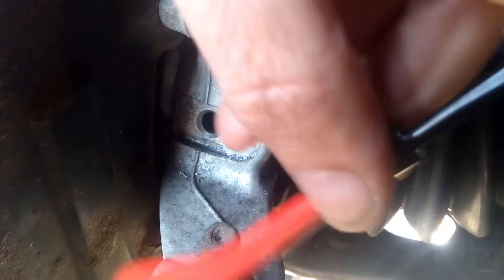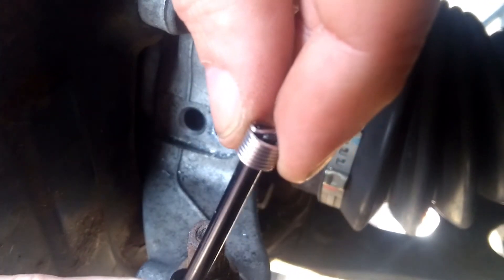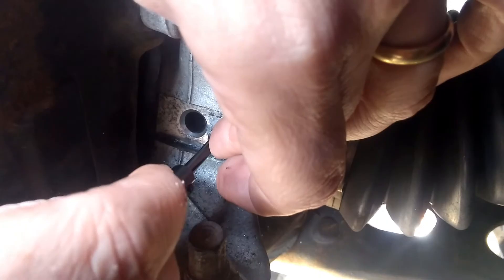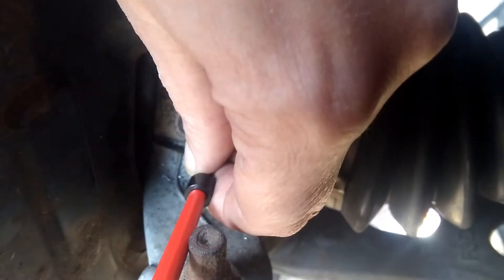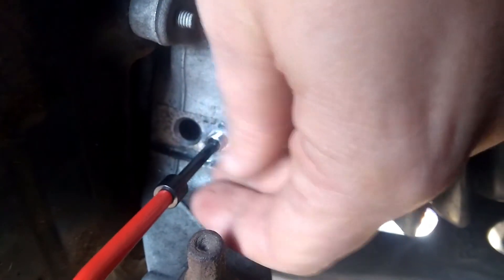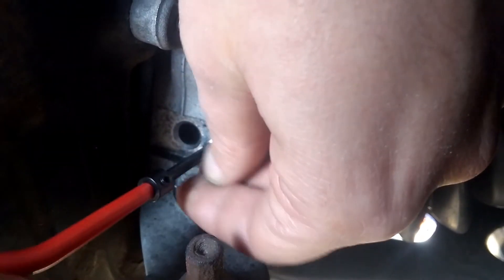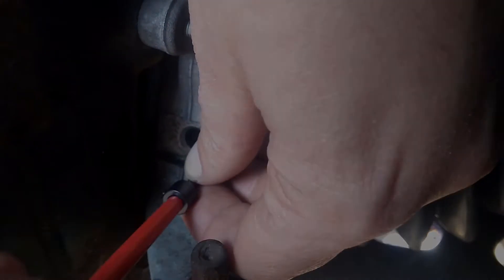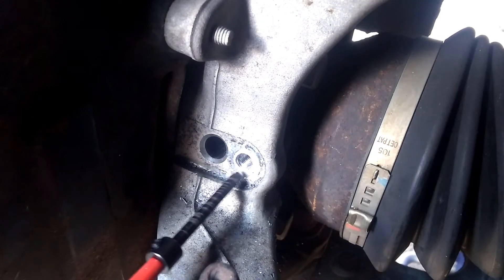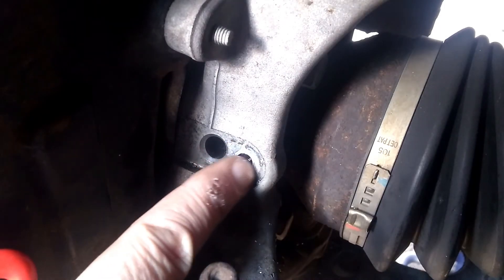We have this insertion tool — it's got a notch here. We pass through from the back side in, and then that goes down into that V-groove. This is one of the differences between the cheaper ones and the Helicoil brand — this one flops around in here, whereas the Helicoil brand insertion tool is the exact right size and is actually threaded as well. But this should work. You want to go so that it's just about a thread, maybe a thread and a half further in, so we don't want any of the coil sticking out.